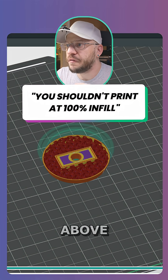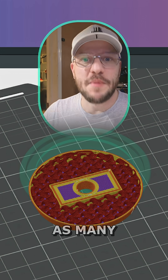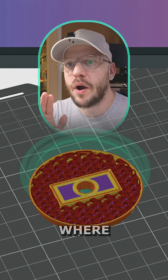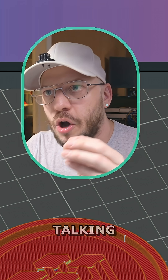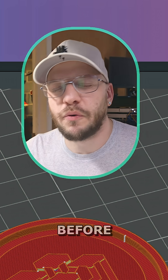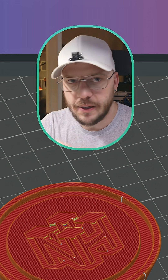There's no need to go above 50% infill or four or five walls, right? As many people have commented, CNC Kitchen's testing shows the diminishing returns of walls and infill. From what I remember from his video, I agree. However, what if we're talking about just a portion of the part being 100% infill? My question is, for threaded inserts inserted by heat specifically, do the same diminishing return rules apply?